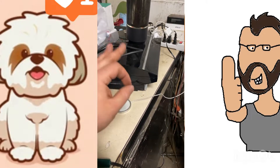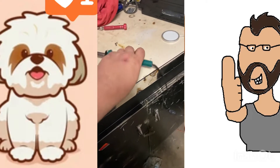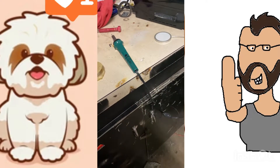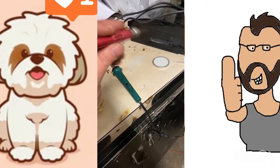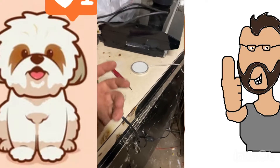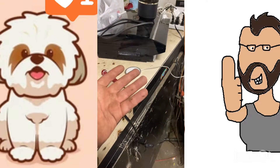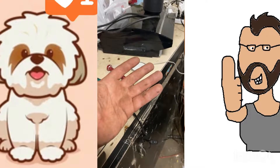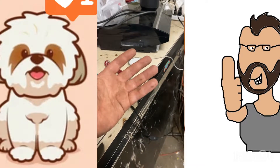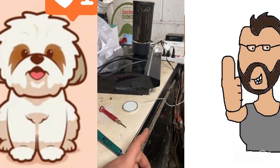As far as circuit boards go, get yourself some solder and a soldering iron — these are like four bucks at the store. Besides that, a precision screwdriver is awesome, but a small screwdriver you've got laying around works too. On circuit boards of something that's not working, we're looking for corrosion, we're looking for spots of solder that should be there but aren't. Typically when you take it apart, you can fix a circuit board really easily as long as you have fairly steady hands.